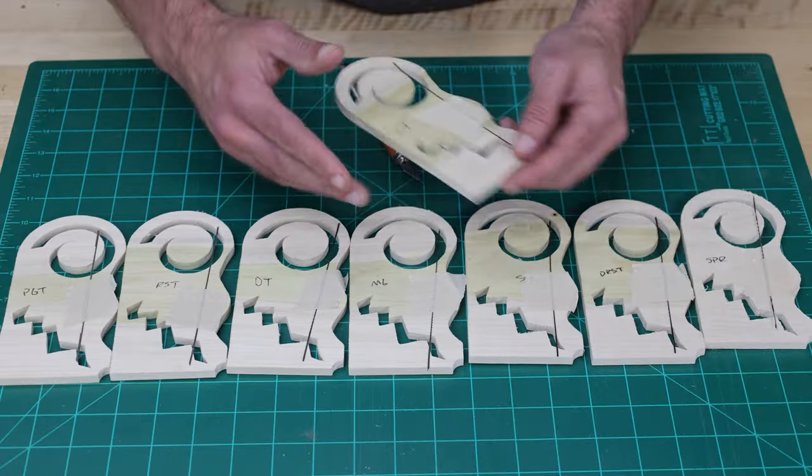I went with the modified geometry blade for number two. The cut was really smooth, pretty much as smooth as the reverse tooth blade. The difference is that there was some more fraying on the backside, a little bit more cleanup work. But when I look at the fraying, I see that this is easily fixable. A little sandpaper will knock off these fuzzies. There was no damage to the plywood veneer on the backside compared to some of the other ones. Number three was the double reverse skip tooth blade. This made up for itself — this was a super poor showing on the wood board, but with plywood it performed much better. A smoother cut, a good quality cut, comparable to the modified geometry blade. As far as the tear out on the back, it's a little bit worse than the modified geometry one, but still pretty good.